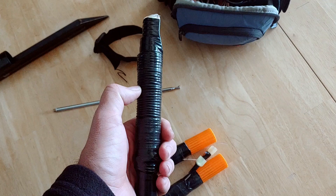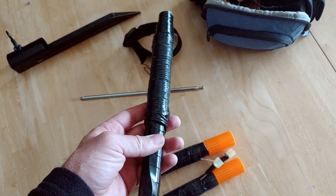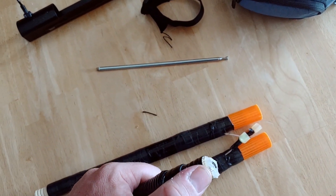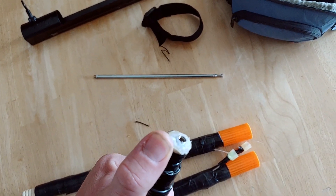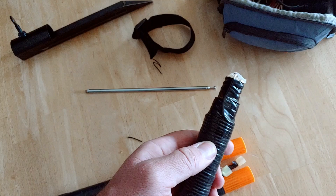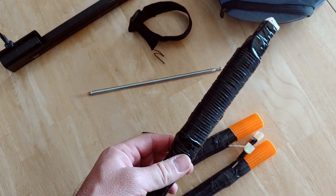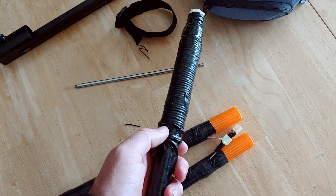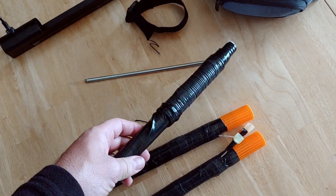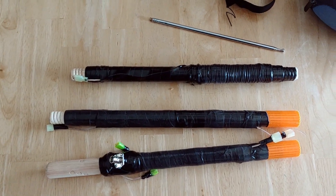What you can see here is a series of coils. I just used speaker wire. What I did is I soldered the wire to the base of the screw connector there in the hot glue, ran it down here, and then coiled it about 48 times or so. I'll have a write-up in the description. And of course I've taped it all up. This is for the 20 meter element — nothing too exciting, I just used a lot of speaker wire.